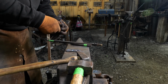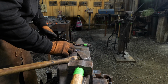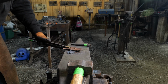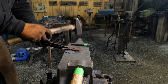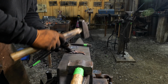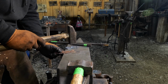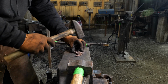The way that we support this front rivet is by putting it in a swedge tool, or basically a rivet bucking tool. We do sell these also at our website. They're fairly economical and cheap. They're just a quick thing, or you can make them yourself. If you have a ball peen hammer around and a mallet, you could whale that into a flat bit of material and create a depression like that to support your rivet head. I do have full tutorials online on how to do those.